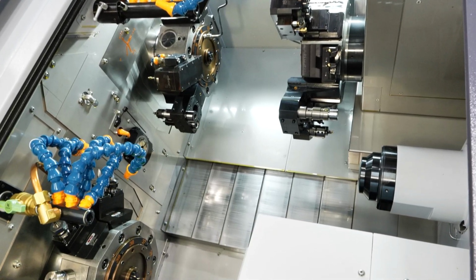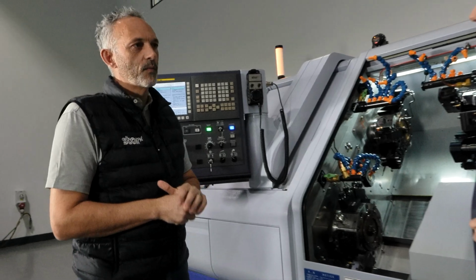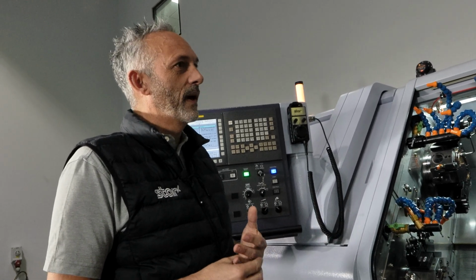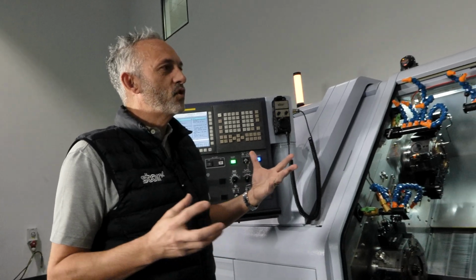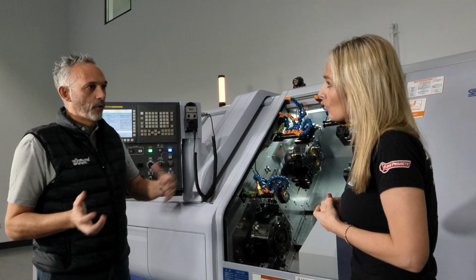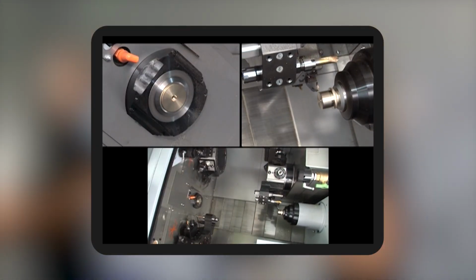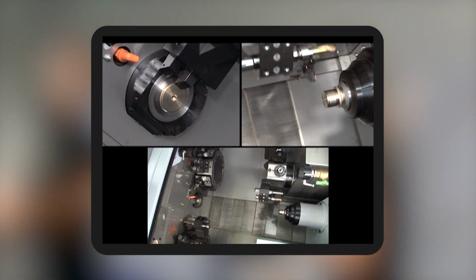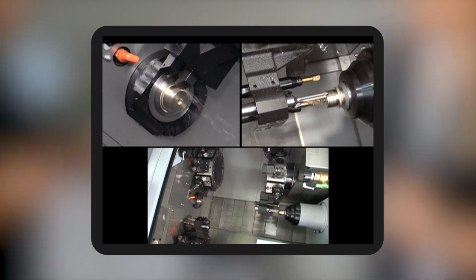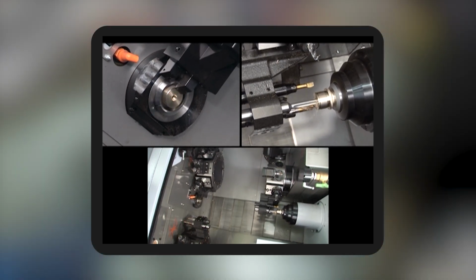So who's likely to go for a machine like this then? As a rule, OEMs. We do sell to subcontract manufacturers and contract manufacturers, but as a rule it tends to be OEM driven, due to the fact that they want multiple parts set and programmed before we deliver it. So uptime is optimum. With having 30 tool stations, you could probably have 10-20 permanently set up jobs in the machine, so it's only maybe a work holding change from one component to another.